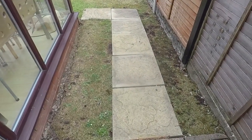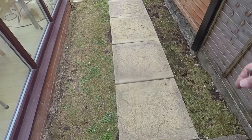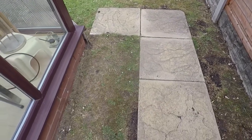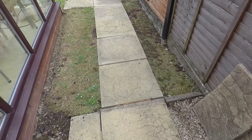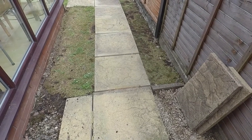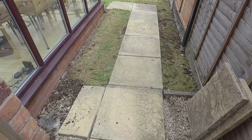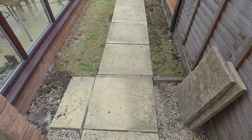It's now a couple of weeks later and it seems to have come out pretty well. This is the slab that was broken and I replaced it — you saw all the foam popping around the sides, but I've cut that off and say a couple of weeks later it's as solid as a rock. I'm quite pleased. It's rough and ready — I ended up using two cans in the end, so about ten quid. For doing the whole side of the house for a tenner, just to stabilize the stones, that seems like pretty good value. It's a lot easier than lifting them all and trying to relay them properly, so it could be a good way of quickly fixing rocking slabs, provided you've only got a few and the cost of a can of PU foam isn't too much to spend.